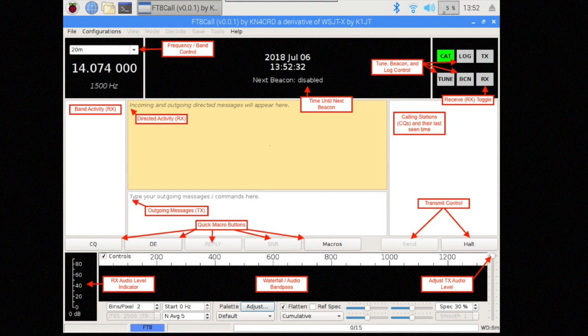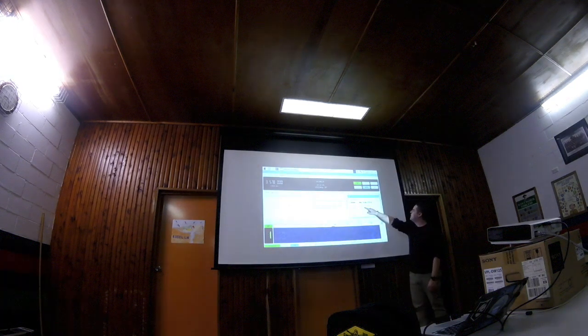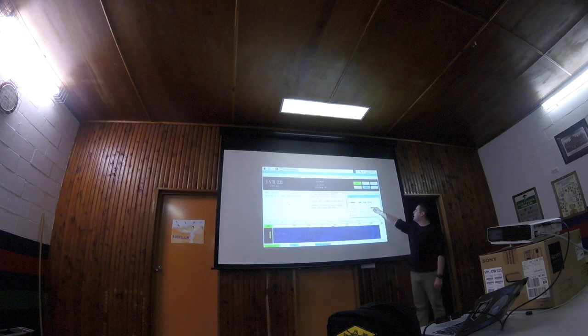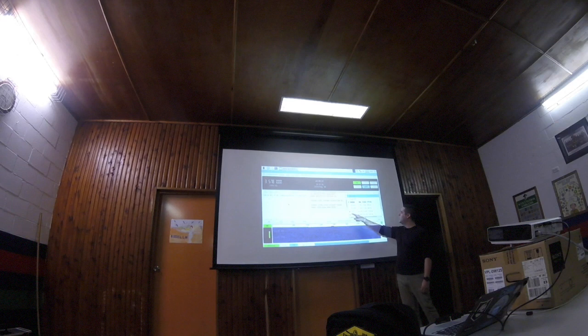Just in the time we've been here tonight, we can hear... Oh, so, when I said about messages, on another band, VK4QM has a message for me. He had it 86 days ago. I just forgot to tell him via the remote control setup to actually clear his message inbox for me. So just ignore that one. But VK3JOX, we heard him 15 minutes ago. He was negative 13 dB, and he was on this waterfall at 498 hertz. VK3MCB, similar. VK3YE, star. That tells me I didn't just hear him, but he can hear me as well.